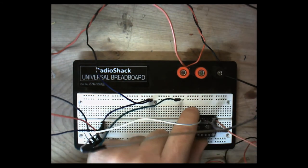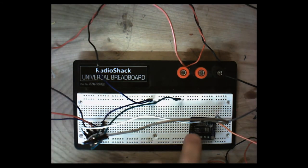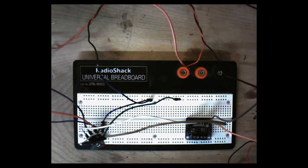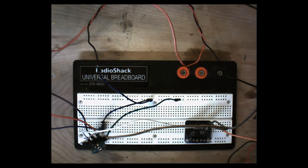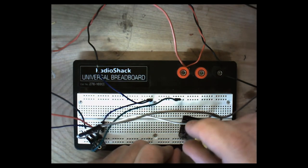All right, so at this point, we've got our microphone wired up, we've got our amplifier wired up. Now we just need to put our bone conductor on there. To do that, we're just going to screw down. And of course, you have to look on this to see what's what. So we've got right out is labeled, right negative. So we're just going to use the right channel since that's what our input is on. So let me grab a small precision screwdriver here, and we're going to put the right in where it says right negative.